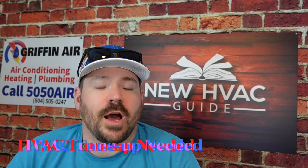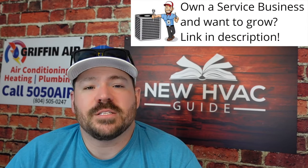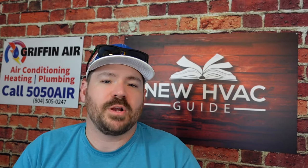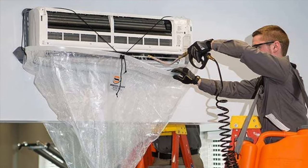Number five: your system may need a tune-up. You may need that system to be properly cleaned to bring it back to running as efficiently as possible — get the coils clean, the sensors, and things like that. I have seen systems that will malfunction and run longer than they should, or run periodically at full speed and not run accurately, running past the temperature they're set to because the sensors have gotten dirty. That system may simply need a tune-up — having those coils cleaned and the entire system brought back to as-new as possible by a pro.